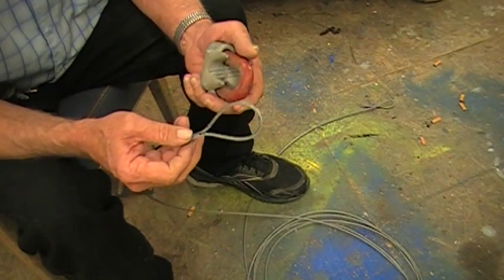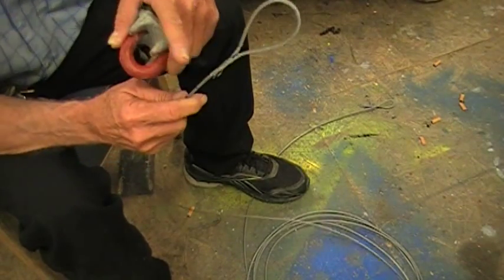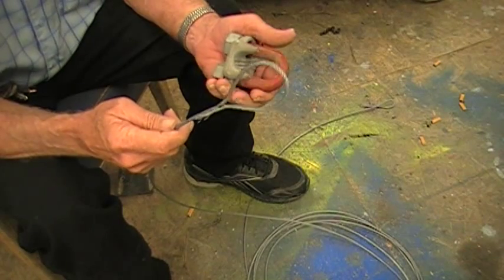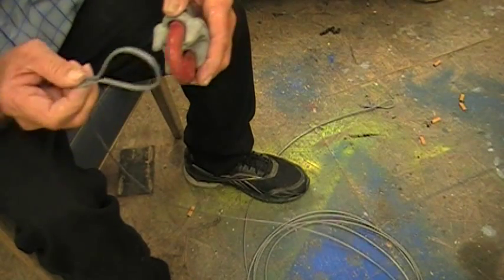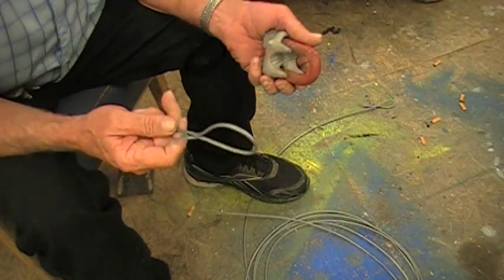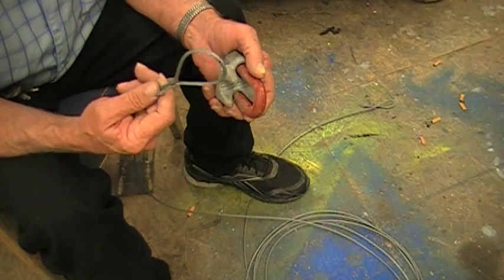Now the question of how to put a cable clamp on cable. If you make an eye splice where you only got one live line, the other is dead. Now this is your saddle and this is your cinch. And a good cowboy would never put a saddle on a dead horse. Therefore, the cable has to go into the cable clamp like so, with the live line against the saddle and the dead line against the cinch. If you have any questions whatsoever, give me a holler and I'll try to go into more detail later. Everybody enjoy. Thank you.